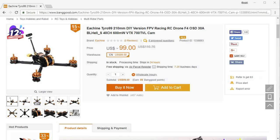The only negative of this build compared to the UAV Futures build is going to be the motors. This is an Eishin branded 2206 2150kV motor, versus the DYS motors you can get for about $10 each, which are similar 2206 but higher kV. So if you're looking for more performance, this is probably going to be a little bit less, but it's going to be a little bit easier to build.